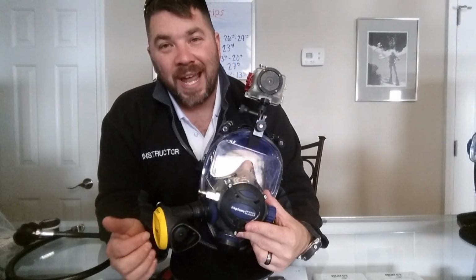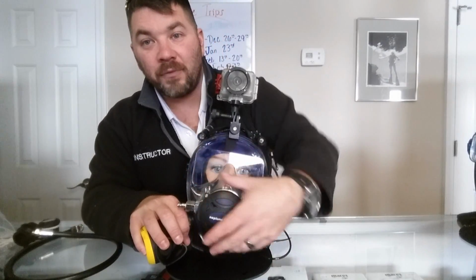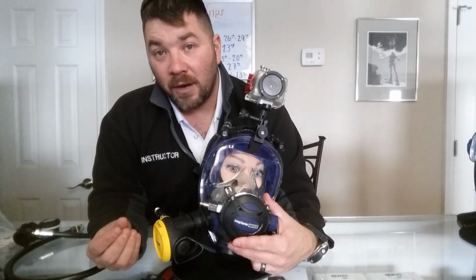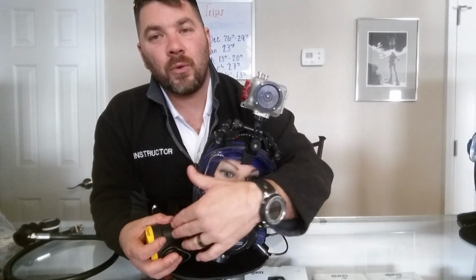So I would actually have to get a technician, or if you are a technician, detune this reg so that I'm breathing off the primary and not taking any air here. However, you want to be careful not to completely detune it, so that if you do run out of air and you start inhaling and taking air from this one, it's not too difficult to breathe. So that's one con that we have to worry about. How do we know which one to use? And I'm going to show you an option there outside of actually detuning it. So what is that option, and how do I use it?